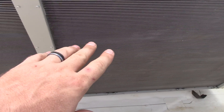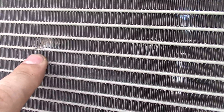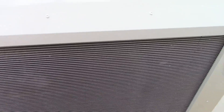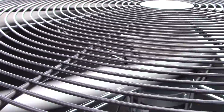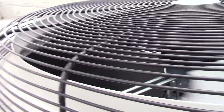Okay YouTube, this is the condenser coil operating. These are ultra-sensitive to damage — look at this little spot here. Oh my gosh, it's been nailed right there. That is probably a guaranteed leak. You always want to look around for damages before it starts up. You can see we've got two fans on the upper part of this, and there's still stuff laying on top of it that we need to clear off.